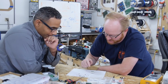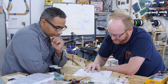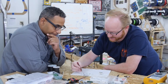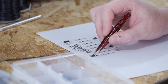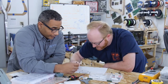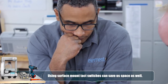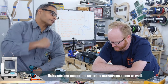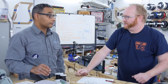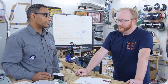You wouldn't know if you'd soldered this correctly until you put this in place, and then if you did have to make a change you'd have to desolder it. We could put these this way and move the buttons in a little bit. I definitely like the idea of having them under the display. If it was a two-sided board, then you just put them on the backside — no problem there. If we make a laser paint version, Felix, we can only do single-sided — or we can do double-sided, but no matter how much paint, it won't line up. Let's just do single-sided.